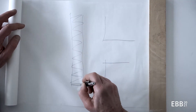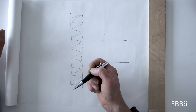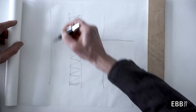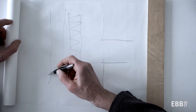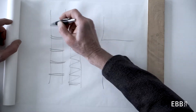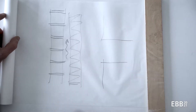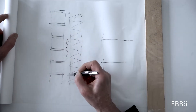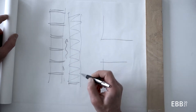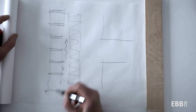The load bearing part is behind what you see. We have an insulation, and according to the weight of the cladding material, we will have to apply different constructions. So the bricks that we have seen are layered in front of the insulation. Very often we have a so-called ventilation space behind this, which is mostly for evacuation of humidity that might occur on the inside.